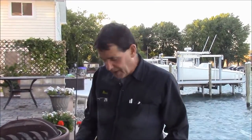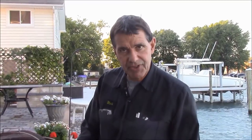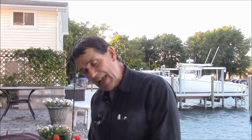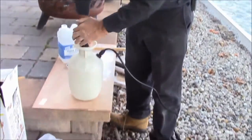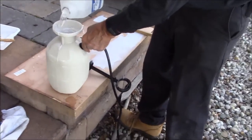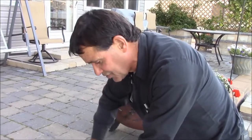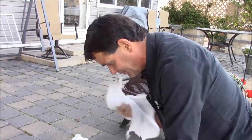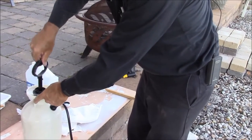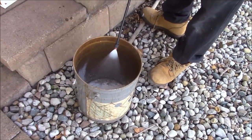In order to clean our tank sprayer, we need to pour out any leftover residue paint that was inside. Then we throw in a little thinner, shake it out, and run it through the hose — we're going to do that about three times until the paint thinner runs clean. A lot of times I'll recycle the paint thinner when it's not looking too bad, put it back in the tank sprayer to help wash it out really well. Each time I add paint thinner I try to get each piece as clean as possible. See the nice fan I'm getting? That's just paint thinner now.